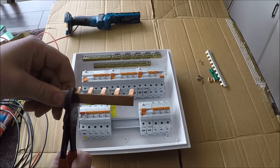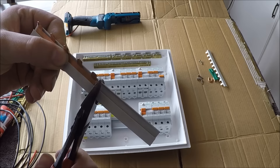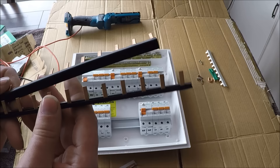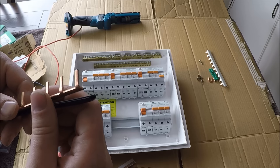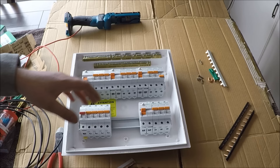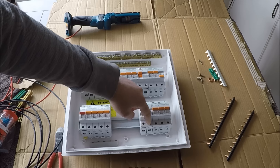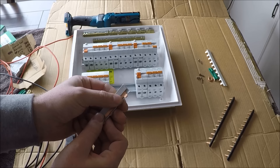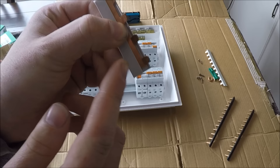I want five bus bars — get your side cutters out, cut it down, and keep it flat so it's not cut on an angle. Cut the plastic off the ends. These bus bars also come with switchboards, but the surface area is quite a lot smaller than these thicker ones. The thinner ones are actually good because you can bend and manipulate them when you've got circuit breakers of different sizes. Since all my switchgear is matching Schneider gear I won't need to manipulate the bus bars. Cut four lengths of four and trim a wee bit off the edge.